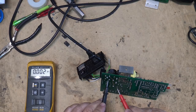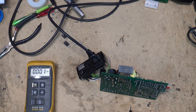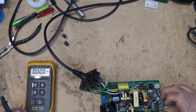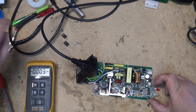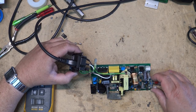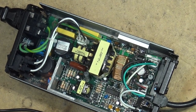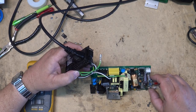We'll check the DC supply and see whether we've got 360 volts. This thing should be running but the oscillator is not going. That could even be the control IC. Something is gone on this. At this rate it may just be better off to replace it with a new one, because the fault is more than those transistors that blew. And I saw what happened when they replaced the fuse — they failed catastrophically. So there could be damage further down in the circuit. I don't have a schematic, so I don't know where the drive circuit comes from. There's a transformer here — this is probably part of the oscillator.